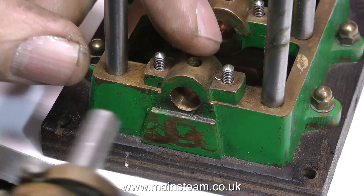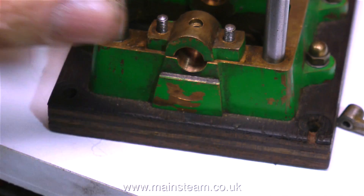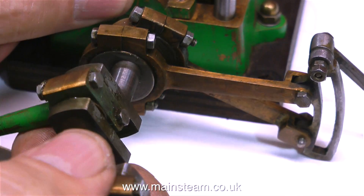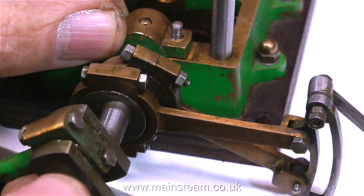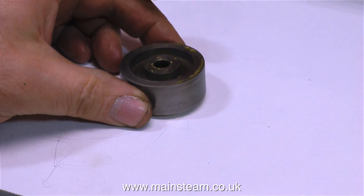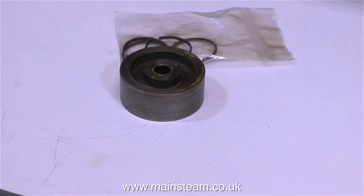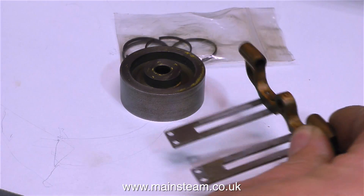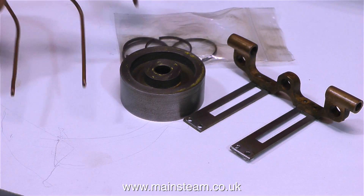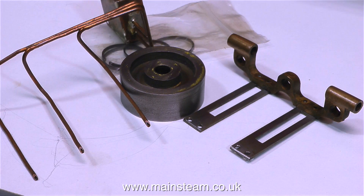It's time to check the state of the main bearings. When I first put it together I put the wrong bearing cap on and it really looked like a rattle fit, but when I put the correct bearing cap on it wasn't. The bearing fits are not too bad — you don't want them to be tight, and I could always machine a little bit off if I wanted to tighten the bearings. So here we have a pile of reasonably good bits: the flywheel's okay, the piston rings are brand new, the oil reservoir is very nice, and the bracket is a little bit dubious but serviceable.